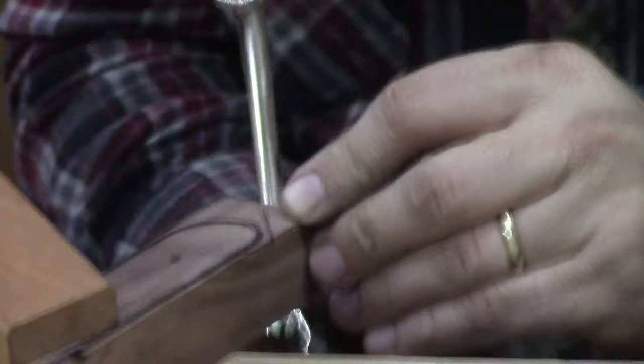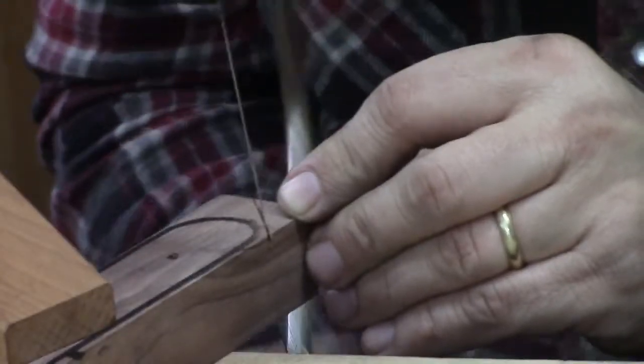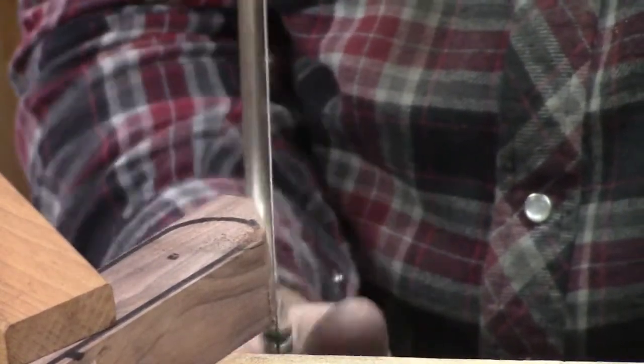And the main thing with a coping saw is be gentle. They're a very good little tool to use, and they cut really thick wood if you're gentle with it. Cut this whole piece out if we want to twist it. Cut all the way around with a different tube. Be careful tilting one way or the other. When people use the coping saw, they want to tilt. And so that's generally why we tell you to go straight up and down like a sewing machine. It makes you less likely to tilt.